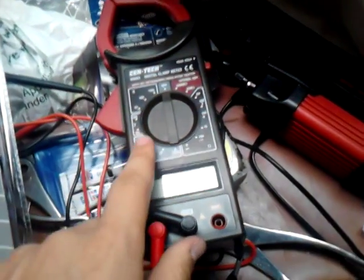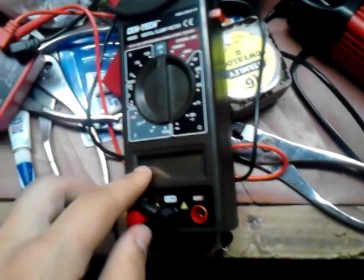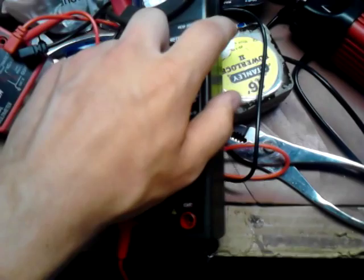One tip I have from using this is that if you try to turn it on and try to get a reading on, say, the amps, and it's just reading 1 for everything, click the button on the side because it's just reading that max of 1. But the test leads are alright. I think they're typical Harbor Freight quality. It's just kind of cheap.